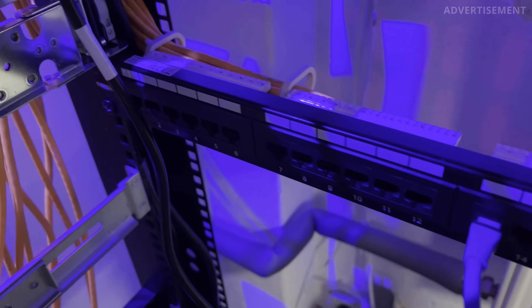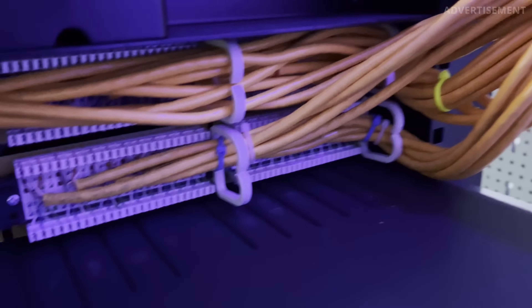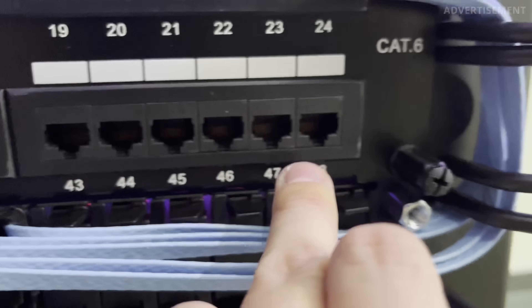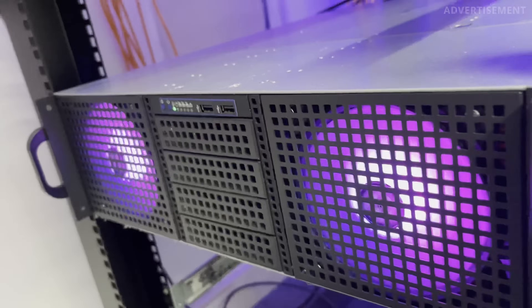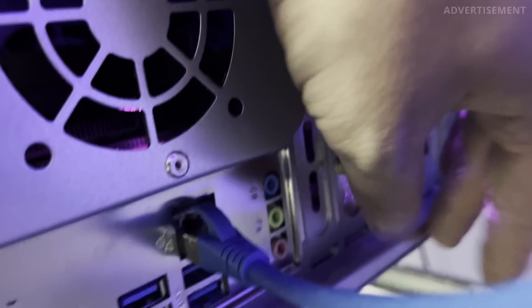That's the main reason I bought these new unshielded Cat6 cables for the setup along with an unshielded patch panel, because that reduced the space needed for cable management, resulting in a more condensed setup, and I could route more cables through the rooms. The next thing that helped me get rid of the cable mess inside the server rack was adding a second 24-port patch panel at the back of the server rack, connecting it with the second row of the 48-port front patch panel. So the second row of the front patch panel, from port 25 to 48, is basically mirrored to the back of the server rack.